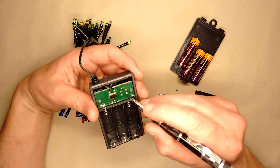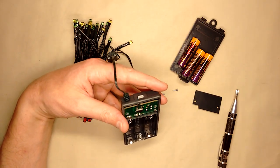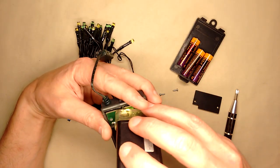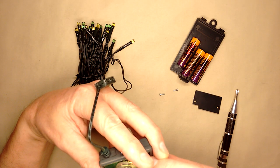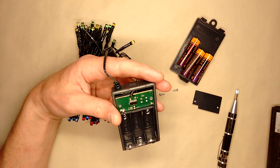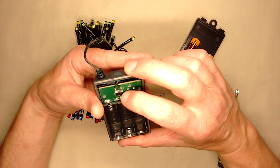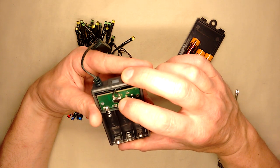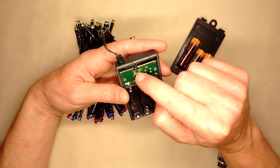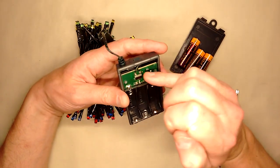Okay, that's new. Does that chip have a number on it? Using my old Micronta microscope — the chip does not visibly have a number on it. That's annoying, but so common. The chip is a 14-pin chip. It's got three common pins at this side, three common pins at that side, and it's obvious that there's a fairly high current H-bridge driver inside that's driving the LEDs.